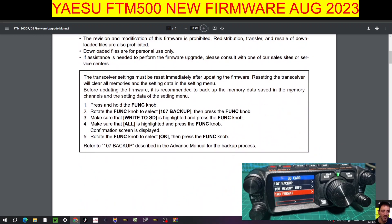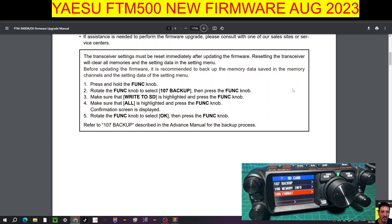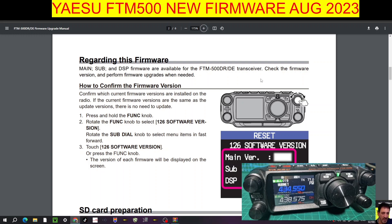There's the upgrade manual. It tells you to make a backup first and shows you how to do that. On the radio: press and hold Function, then go up to menu 107. The faster way of moving is to turn the bottom dial; fine tuning uses the other one. Press Backup, then select right to SD card and after a while it will back up. If you've never put your SD card into your FTM-500, you need to format it first — go down to Format, push that, and then back up afterward, because formatting prepares the SD card and adds the necessary files.